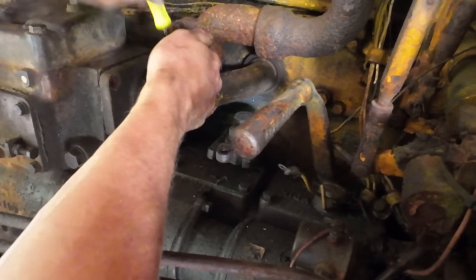So we turned it down to the proper size that we need for the bushing end of the intake, and then Sam TIG welded this end on up here. This is actually cast, so the welding process started out a little rocky because we thought it was mild steel, but he got her buzzed on there. Plenty good enough for who it's for. That fits down in this end. That's why this flange is on there, so that seats down in there. But yeah, we're ready to bolt this thing back together. I tore the gasket a little bit here where these two halves mate, but that's not a big deal. Just put some Permatex number 2 around there and crank the bolts down.